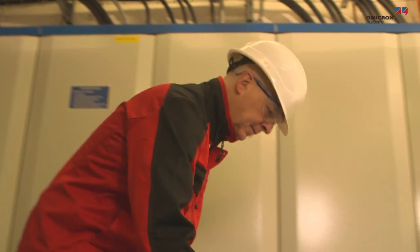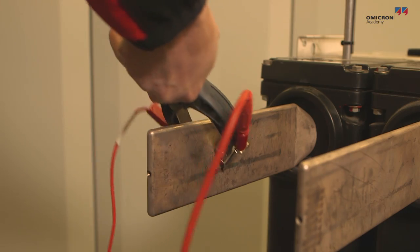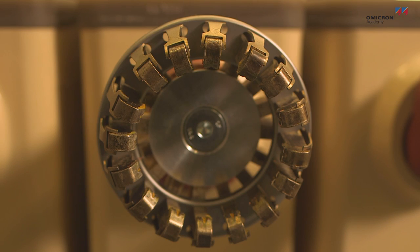Kelvin clamps work well for massive connectors that keep the current and voltage path separate. Circuit breaker tulip connection contacts make it literally impossible to make a proper connection to the breaker contact, because the individual brackets are interconnected, which makes a connection with an independent current and voltage path impossible.